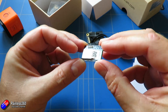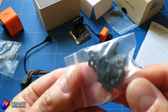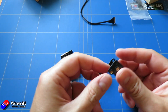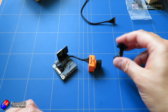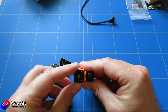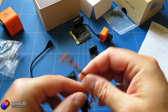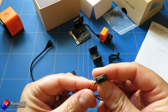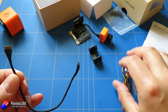Under that you have a little bag of cables with various fixings and PCB standoffs, which is a nice touch. You also have a mount for the camera so you can, with a couple of screws, mount it directly onto your frame. It also has an adapter, because the size of the camera is the new Swift Mini size — so if you have mounts already on your frame for something like an HS1177 camera, or you're replacing something like an Eagle or an Owl 2, then by using this adapter it'll fit perfectly. There are a couple of other cables as well — a standard USB out cable, and also a cable to connect it to your FPV transmitter, plus an extra long cable to connect the camera back to the PCB if you want to change that out.